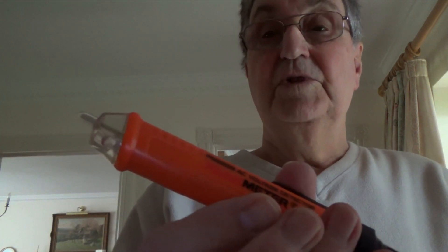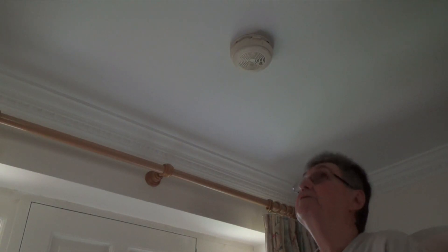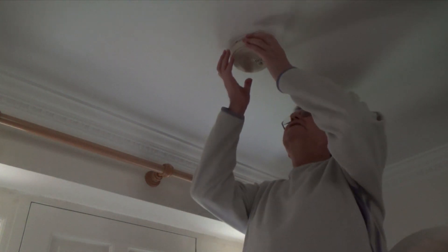There is a battery backup in this drawer, so in the event of a power cut the smoke alarms will still work. Top tip: make sure the LED power lights have gone off on both smoke detectors, because if they are on different circuits — which they shouldn't be — there may still be voltage in the interconnecting cable from the other detector. I've confirmed both LEDs are off with the circuit breaker. I'll be using an insulated screwdriver for safety and a non-contact voltage detector to prove the power is actually off.